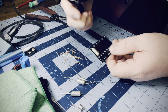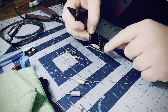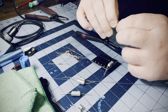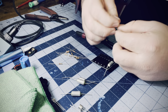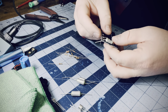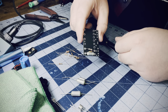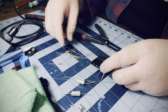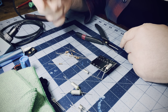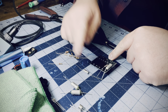There's a one meg resistor that goes from the base of Q1 to ground. This solder pad down here is ground, but it also grounds the attack pot and a few other components. On Q1, you'll also see this 8.2K resistor that comes off of Q1's emitter and helps bias the transistor.